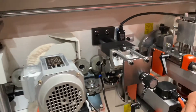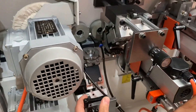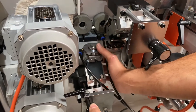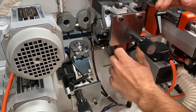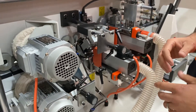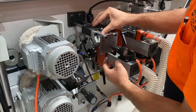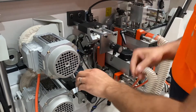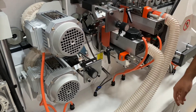Scrapers: to disengage them, if you want to take them off completely, loosen off this kip lever, pull them right back, and tighten that up. That will disengage them so it won't cut — you can leave a little bit extra on if you need to. If you want to re-engage them, make sure this area is clean, push them in till they hit the end — same here — and they're engaged, ready to go.